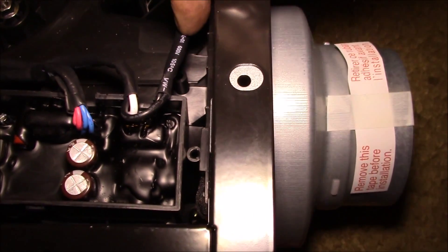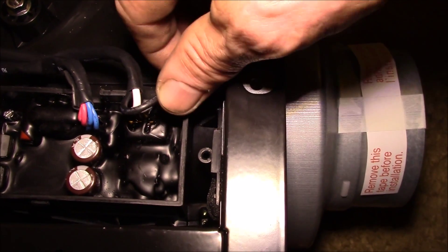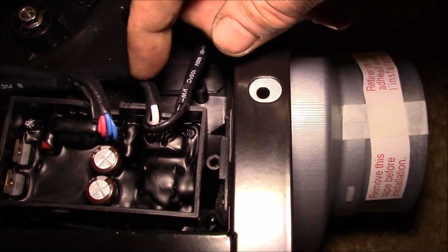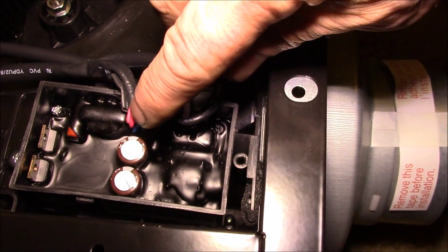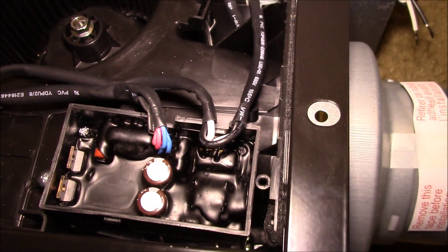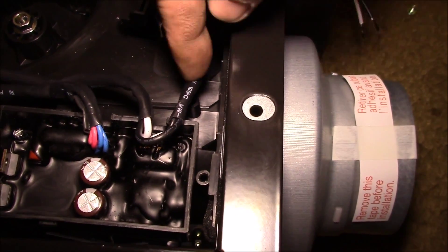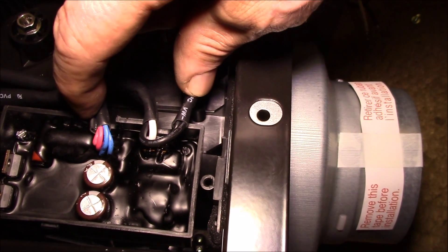For phase two of the project, here's the electronic ballast. The power wire comes in for the ceiling light and nightlight — there's a single white and two black wires. One black wire goes to the nightlight connection; the ceiling light wires go into the ballast and come out as two blue and two red wires, connecting to the four pins on the CFL bulb. After testing, I'll cut those wires and join the nightlight wires and the CFL wires to bypass the ballast.